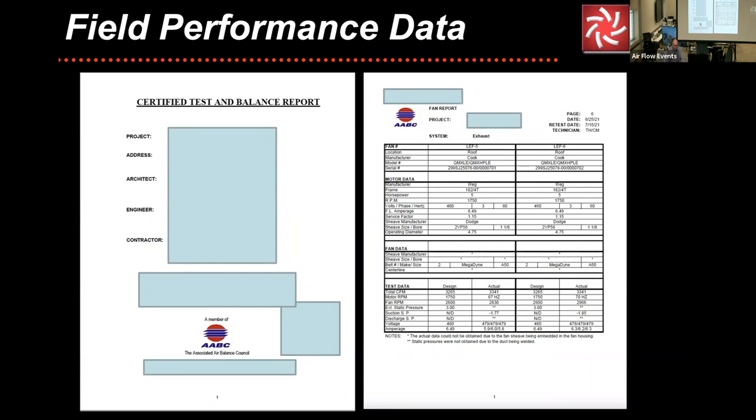So in this case, we also have a suction, but we do not have a discharge static pressure. This particular product discharges into the atmosphere. So that's why you do not have a discharge static pressure. If it was ducted in, ducted out, you'd have the static pressure on the suction side, you'd have the static pressure on the discharge side, and here is something that often comes up. You must take the absolute value of both and add them together if it is ducted in, ducted out. So in this case, if we had...